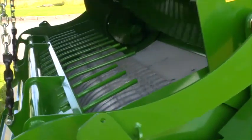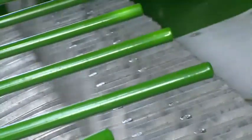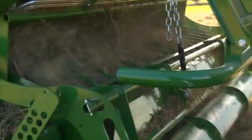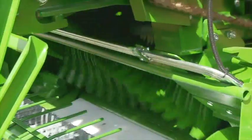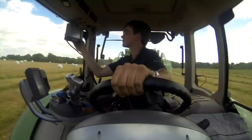The McHale Fusion 3 Plus also features a 2-meter, 5-tine bar galvanized high intake pickup, a split drive gearbox, a chopping unit which boasts a heavy duty rotor and comb, and a selectable knife system to control 2 individual banks of knives from the tractor cab.